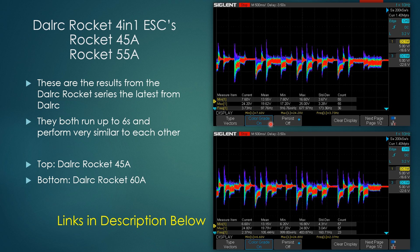These rankings don't go from best to worst — they all have advantages and disadvantages. Next is the Dal RC Rocket 4-in-1 ESC. We have two versions: the 45 amp and the 55 or 60 amp. Both perform basically identical — the top is the 45 amp and the bottom is the 60 amp, and they're right on par with each other. It just comes down to your budget. Maybe the MOSFETs are slightly better on the 60 amp, but you won't really notice the difference. Both run up to 6S, which is great. These testing results were from 4S.